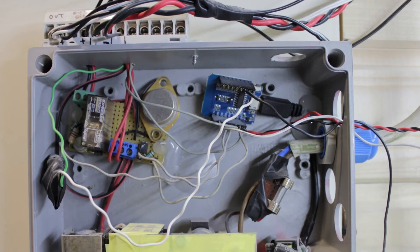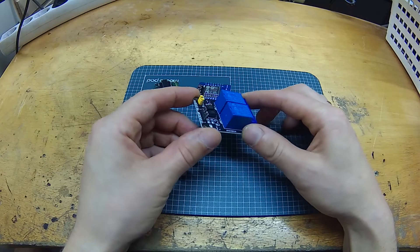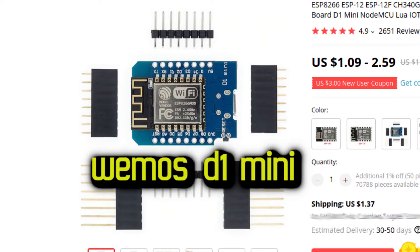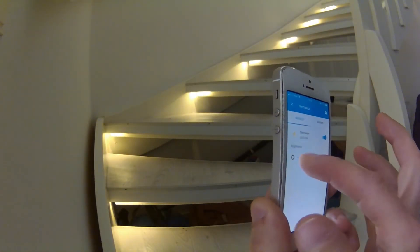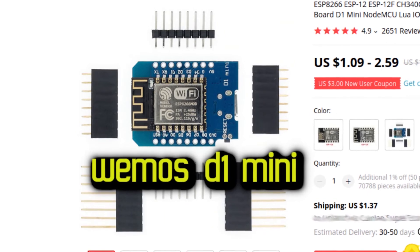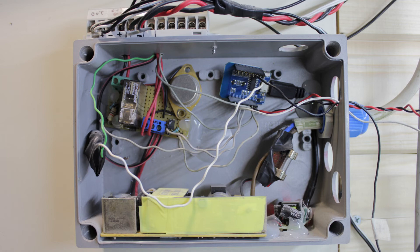So that's the only place in my house where having a Sonoff Basic was actually suitable. And I still had to modify it a lot — putting the sensor in, flashing, and so on. So why don't I use it anywhere else? Well, almost all of the places in my house where I need an ESP Wi-Fi chip, I usually have different switches, relay modules, and sensors all located in one place. So I need a lot of available inputs and outputs on the ESP chip, and in some places I need to use different voltages — for example, dimming a 12V LED light. So it's a much better idea to use one ESP board like this and just put together a setup like that and hide it somewhere in the closet.